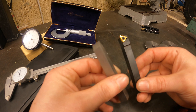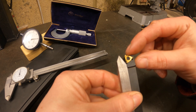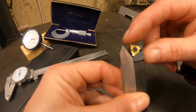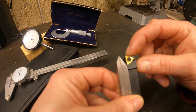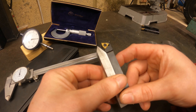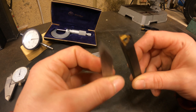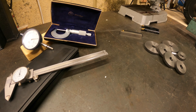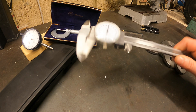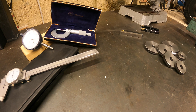What you need are thread cutting tools. I've got a high speed steel one and a carbide insert one here. They'll both do exactly the same thing — just two slightly different tools. The key feature is the cutting tips, which are 60-degree cutting tips, so they cut a 60-degree angle into your thread. That's what you need for most conventional threads. You'll also need some way of measuring your bar stock, so you can use calipers or, as I've just made a new purchase, I'm going to be testing out my new micrometer.